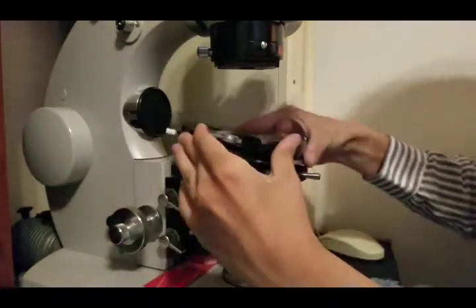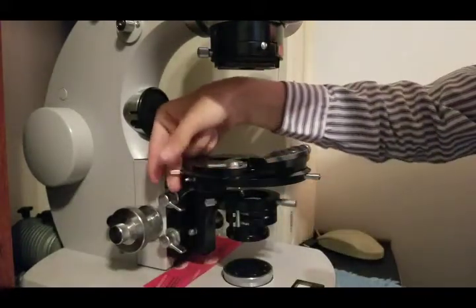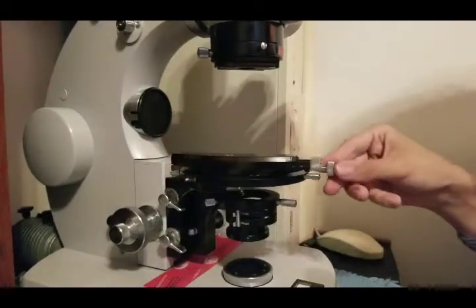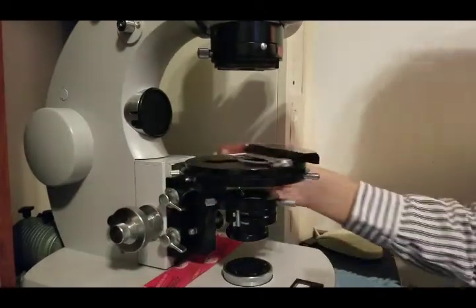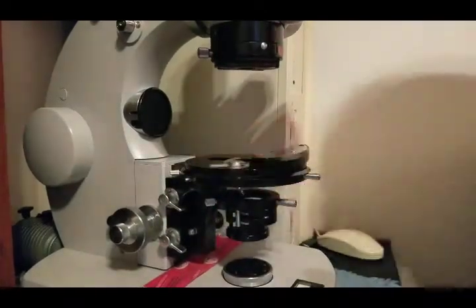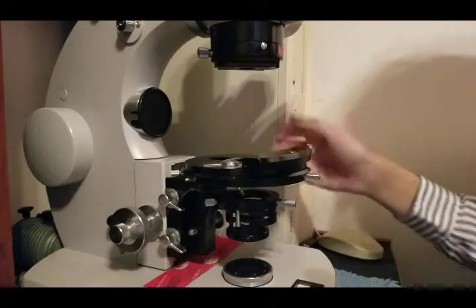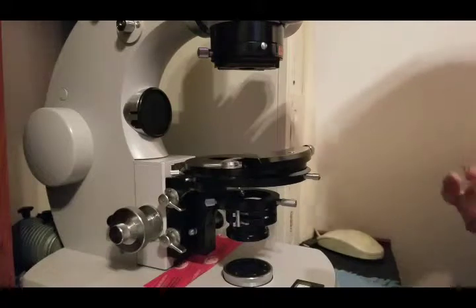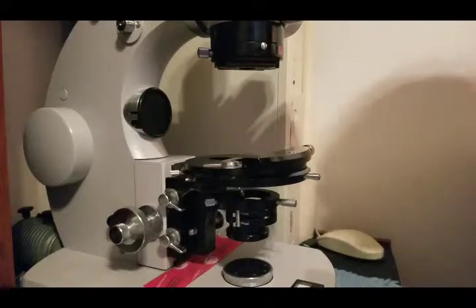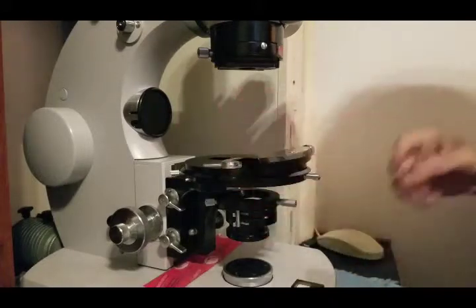Let me put this back on real quick and I'll show you another feature that I really like that you don't find a lot. This microscope has the capability that when you loosen this little screw over here, it can rotate - roughly 300 degrees before it hits any of the knobs. And this is a nice feature if you want to look at something or take pictures of something and you want to flip it over, because if you flip it over you could lose the adjustment you have on the stage. You can also do this while the objectives are in place, and you'll notice I have the objectives out at the moment so I can show this in better detail.